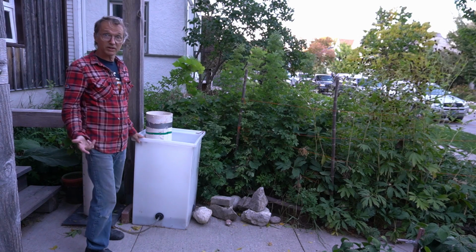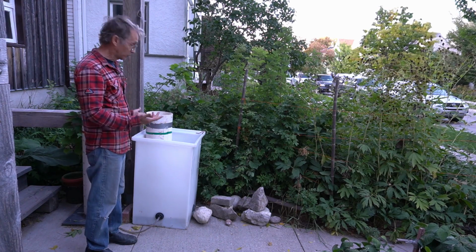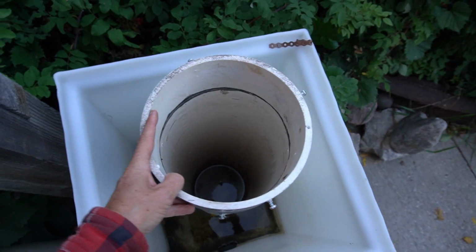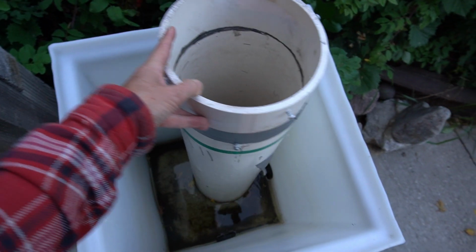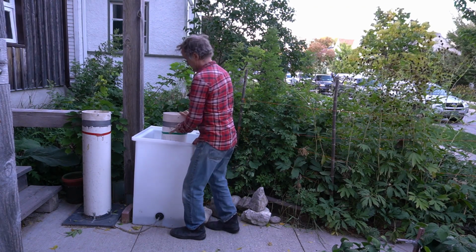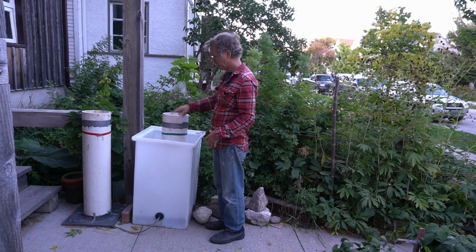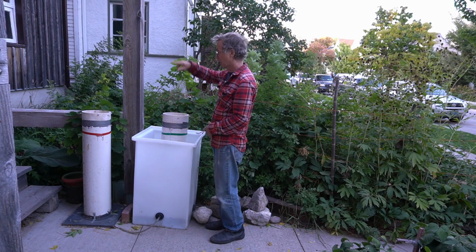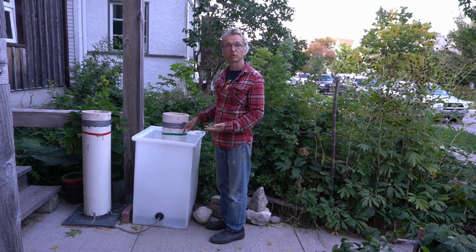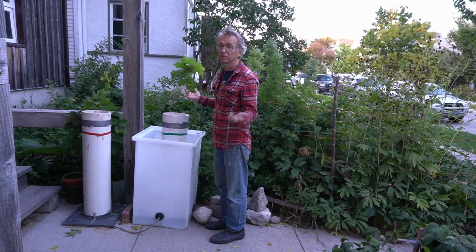So of the things that I would still like to do here, this is one. This will be for grey water, and there will be a tiny treatment center. What I'm going to do is put these old PVC tubes, pipe, and stack one on top of the other, and fill them with broken glass, and basically have a little pump system. The pump will take the water, dishwater, pump it up, and trickle it down through all the broken glass. So basically a trickle filter. You could use sand or gravel for the same thing, but why not broken glass?